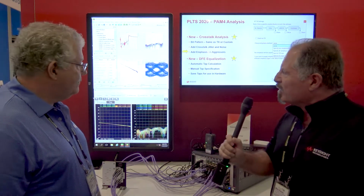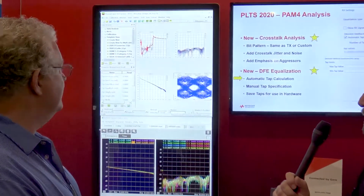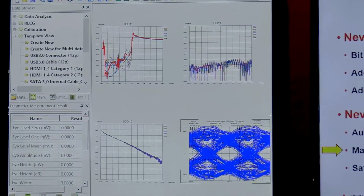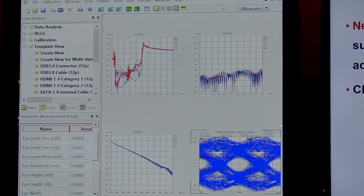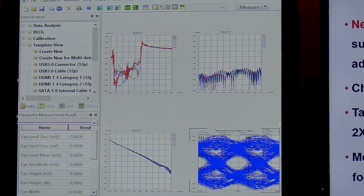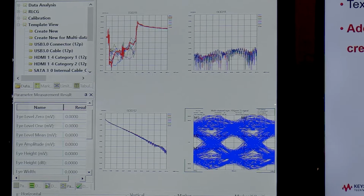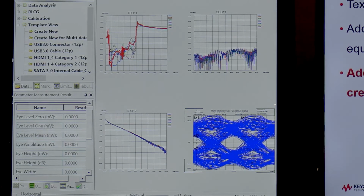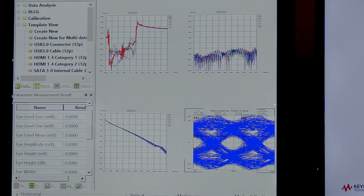That's right. So looking at the TDR impedance profile there in the upper left-hand plot, it does look like there's a bit of excess inductance and capacitance, but as you mentioned, we're looking at some very precise and blown up vertical scaling on the impedance. And we've plotted all of the various channels and overlaid all of them. So you can see the repeatability is actually quite good. And then looking at the NRZ eye diagram, you can see how we've got a very wide open eye, very, very acceptable jitter, and it looks like the insertion loss is absolutely flat over every single differential channel inside that mezzanine connector. So it's really quite an amazing component, and this is going to enable some very amazing hyperscale network physical layer systems to be designed and developed by your customers, I would imagine.